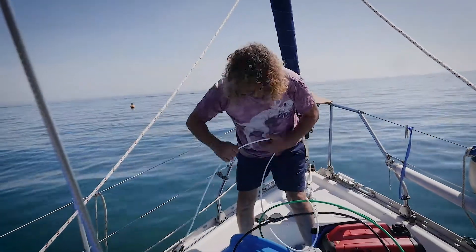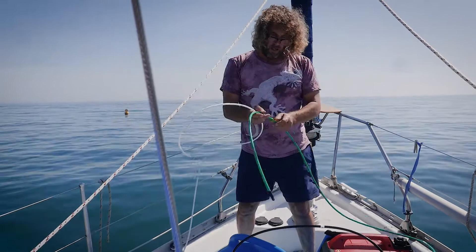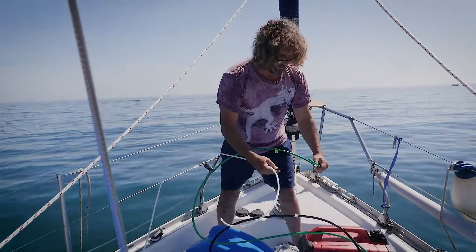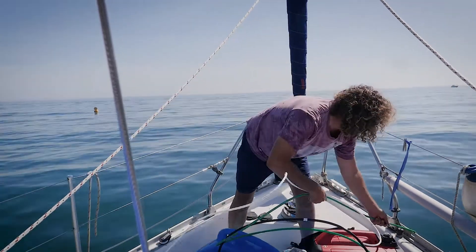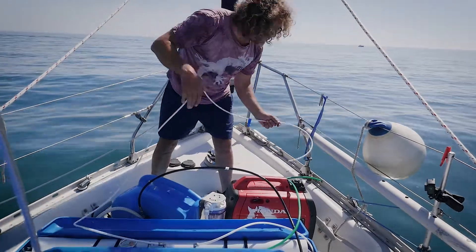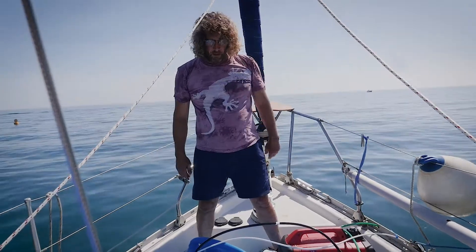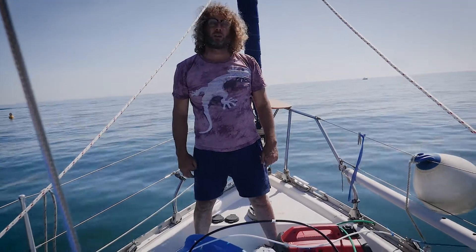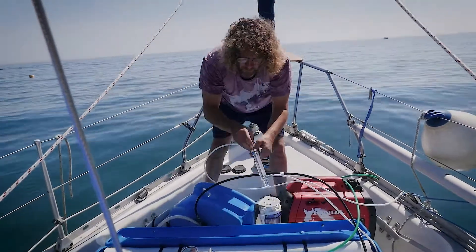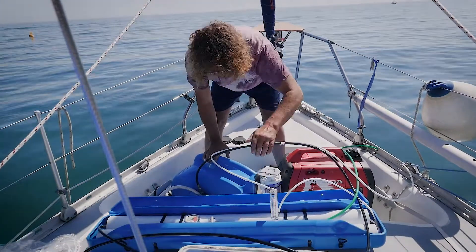So this must be product water. And this is my brine output. My brine output over the edge of the boat. Product water — I'll leave over the edge of the boat for now. Pickling solution in. So I'm going to run this for 30 minutes to make sure that the pickling solution is fully run out. One of the features I like about this is it comes with a lovely flow gauge. We'll be interested to see how that does. As far as I know, we are ready to go.